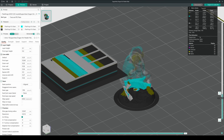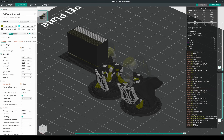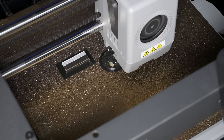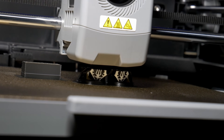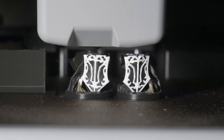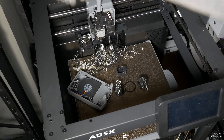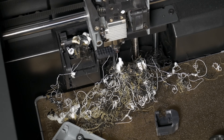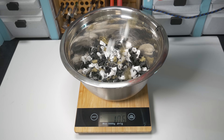After spending only 20 or 30 minutes on this model I had some colours assigned and ready to go. Originally I had aimed for four colours, but with almost a thousand filament changes I decided to drop down to just three. I also wanted to try a smaller nozzle, so I threw on my 0.25mm to the AD5X and hit go. Even though this print started out great, I did have to leave it overnight, and woke up to something of a 3D printing nightmare. The models came free from the bed, the purge chute was backed up and spilling filament, and the toolhead casing had popped off. After a 24-hour print and a ton of wasted filament, I had to admit defeat and chalk it up as a failure.